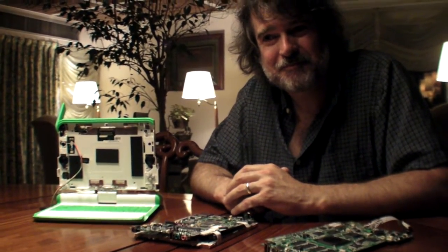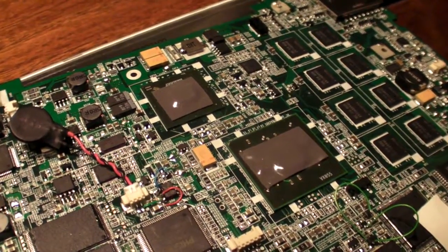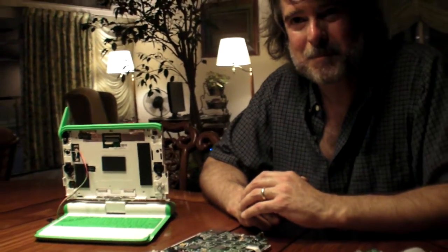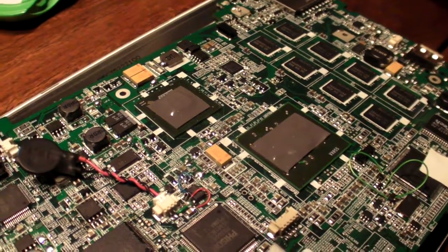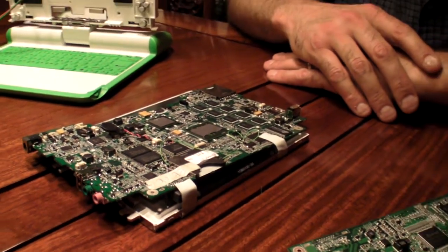Right now this is basically just Intel doing all these netbooks mostly? The interesting thing about Intel is their companion chip is still a desktop system. That will change in the next month as Intel introduces a new system, and there will be a lot of netbooks introduced with it — however, they tend to go for a larger display and price up. Just to explain what the companion chip does: it is everything but the processor. It is the interface between the processor and the memory, it provides your graphics, and through the south bridge it provides the interface to all peripherals — your USB, IDE, SD, networking, and audio.